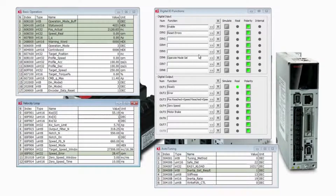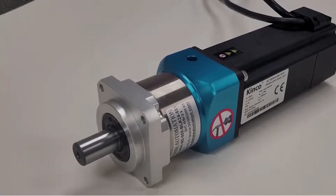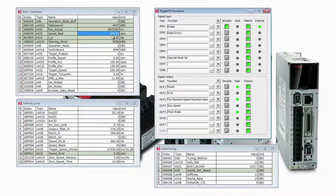What I'm going to do is add just values of 1 to the KVI, run it, and see if I can get this speed reading to really stay around 250 as tight as possible. That's getting to 263, 248 — see if I can add another one. The whine is down much more, so there's not so much of that hum in the body of the motor anymore. It is staying better around 250. Increasing to 500 in real time — it's doing a lot better right around 500 there as well. Putting this up to about 3 — really sticking around 500 now, 504, 495. That's doing a very good job.